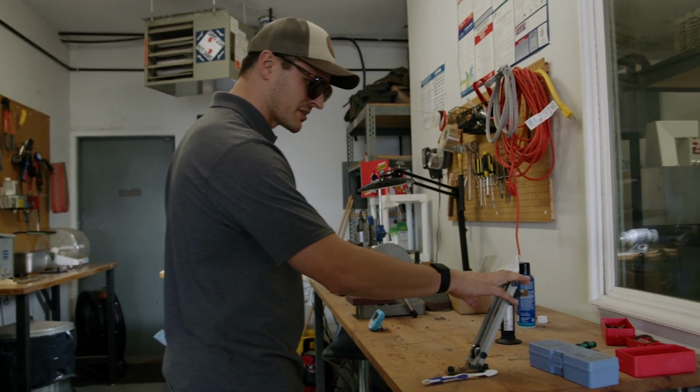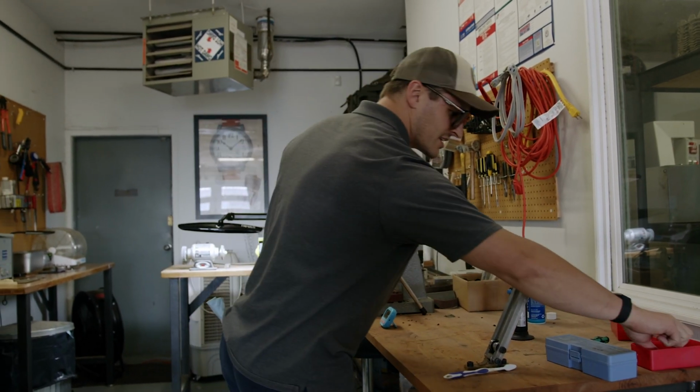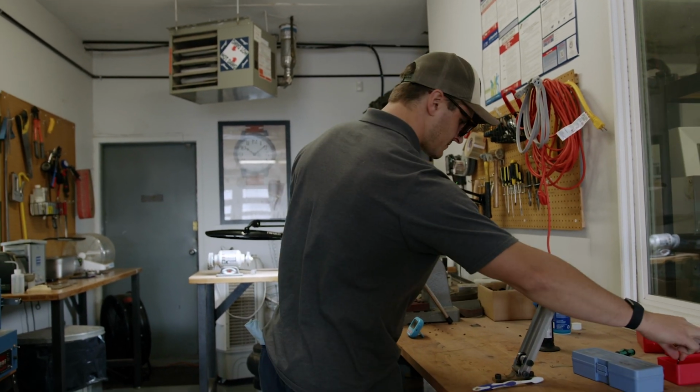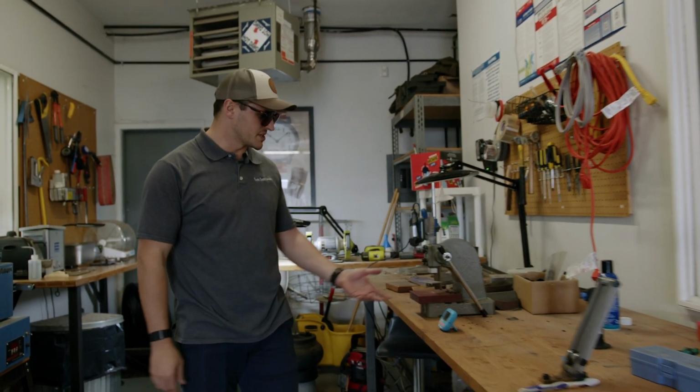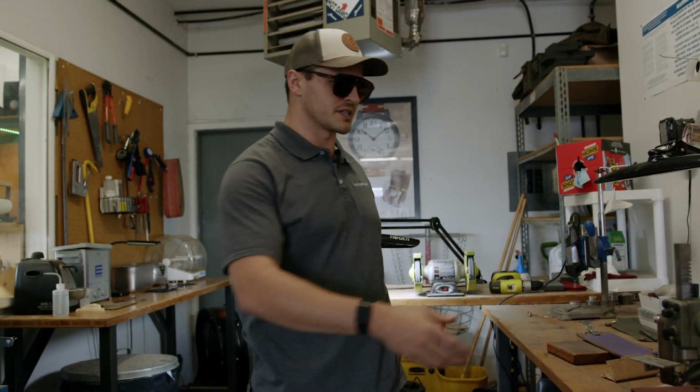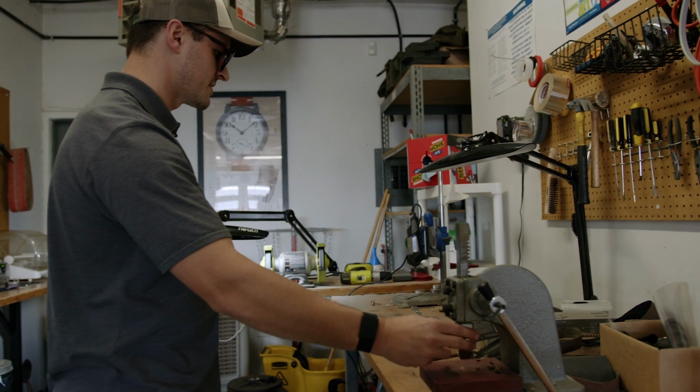This is for bending our buckles. We machine them straight, kind of like this. And then we bend them. Here's where we punch our straps. We have our crown at 12 o'clock, and sometimes that interferes with the strap, so we use this arbor press and some custom tooling to punch that out.